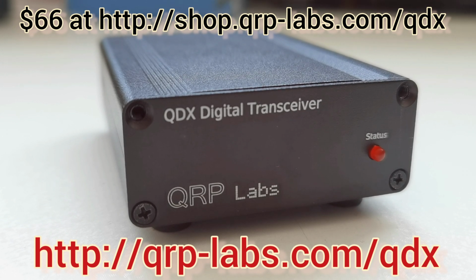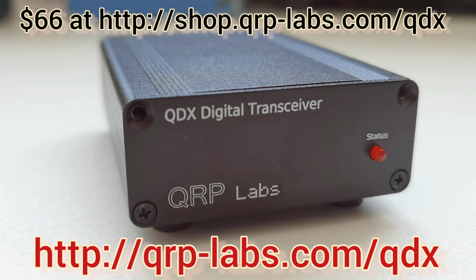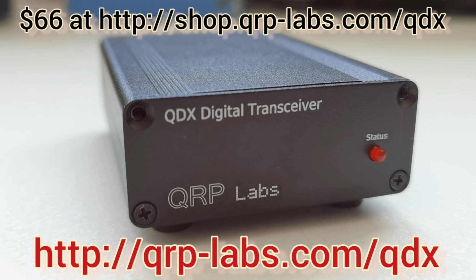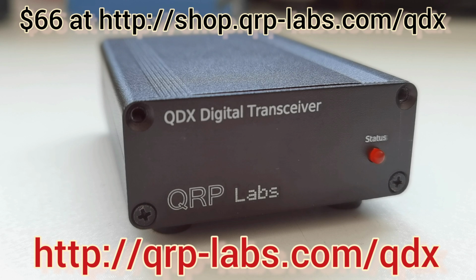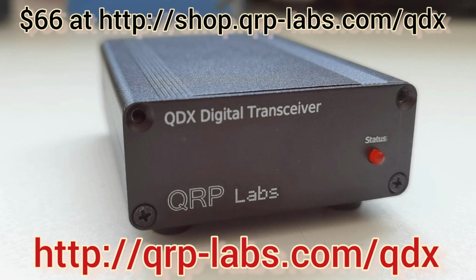It's very hard at the moment to get the chips that you need due to the global semiconductor crisis, and the processor chip and the ADC chip were particularly difficult. The ADC chip, the AK5386, is now obsolete because of a factory fire a couple of years ago at the Asahi factory in Japan. So there was a necessary change: find a new chip and do necessary redesign work.